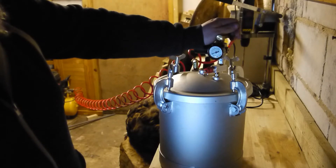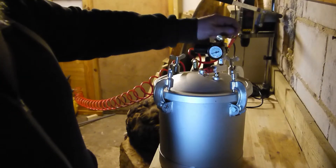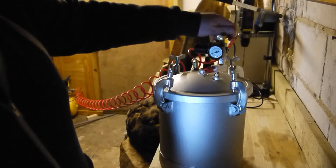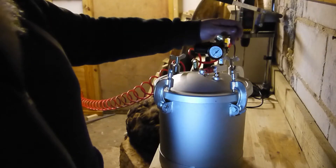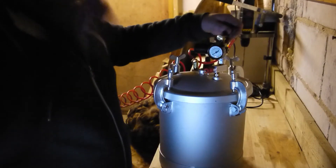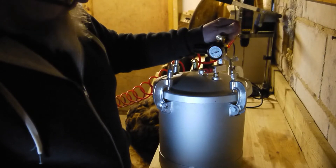The tank's back full now — that's my air compressor. That's 40 PSI and I can hear the blow-off valve starting to let some out. If I go a little bit more — don't do this at home — it should pop, and that's what the blow-off valve does. So it looks like it is set to about 40 PSI, which is half the working pressure. For alumilite, just under 40 — 35 PSI — is perfect.